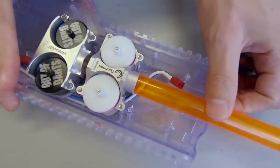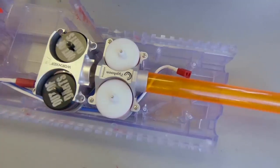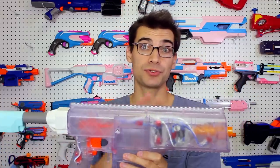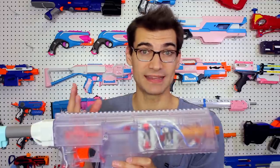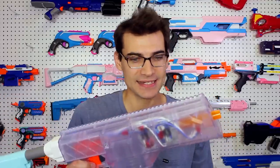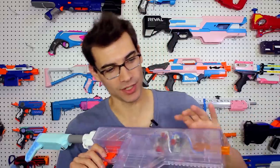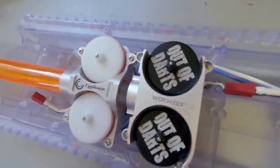There are some issues with wiring things up. While there is a nice wire channel for things to run through and keep separated, the design wants you to wire things directly to each stage so they're all set in and you can't remove anything. It would have been nice had they accommodated people who want to swap things in and out. I have done removable cages on all three stages here, so I can run from one to three stages whenever I want by popping cages in and out via Dean's connectors.